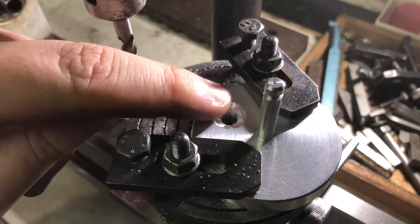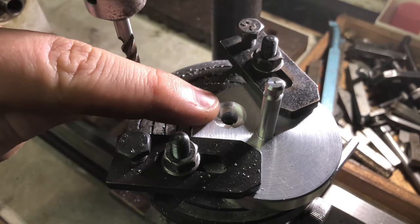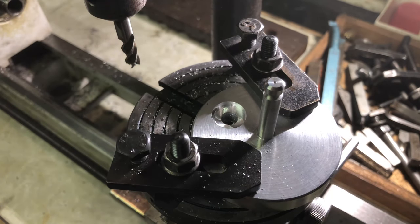The other thing I've got left to do now is just — those edges there have just got a nice burr from a nice brand new sharp cutter. I just need to tidy those up with a file or see if I've got a decent-sized deburring — countersink, that's the word. So, the final stage for this now is to file that central 6mm hole to be a square rather than a circle. So, what I'll do is I'll take this off here, move it over to the vise, get it set up ready for filing, and I'll see you over there.